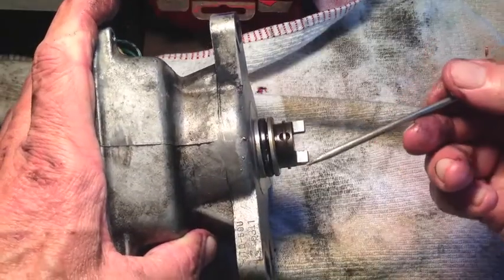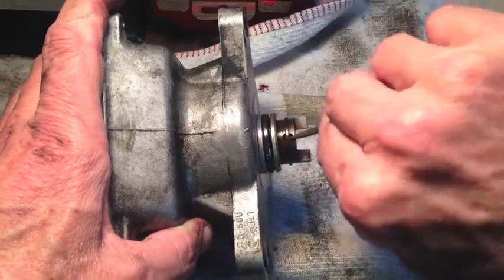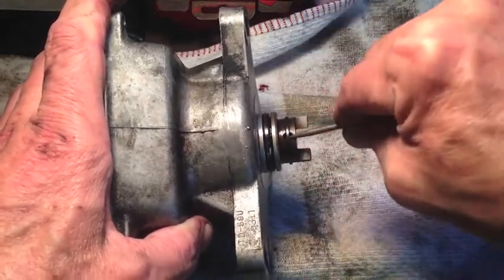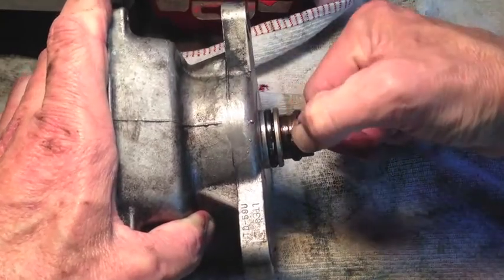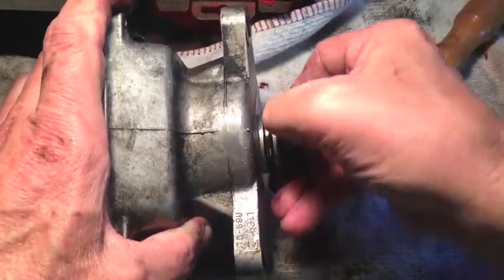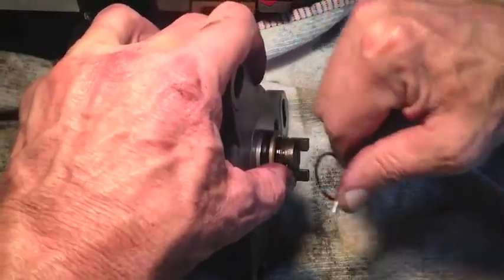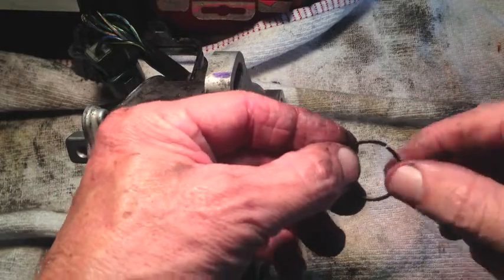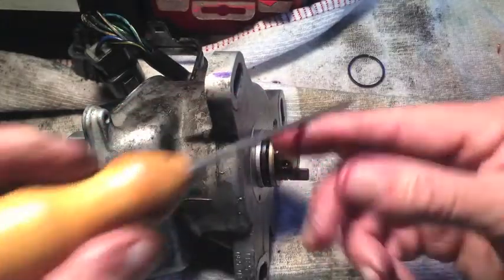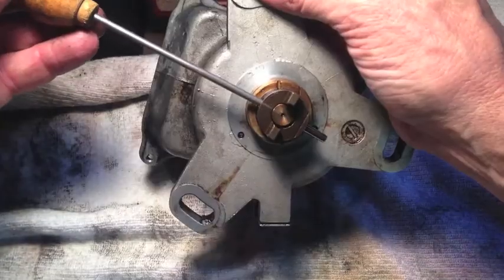There's a lock ring that has to come off. I'm going to use this pick — there's a little indentation in the metal that allows you to put something down in there like this pick or possibly a screwdriver and get that ring pried off just like that. And obviously don't lose it, because if you do you're in trouble. There's the lock ring, which has a little break right there in the metal. Down in that hole right there there's a pin that we're going to need to push out, so using this same pick it should come right out.